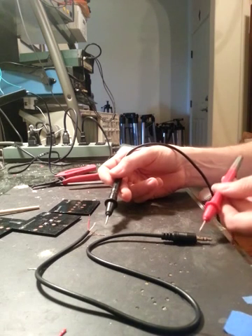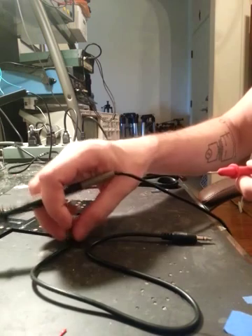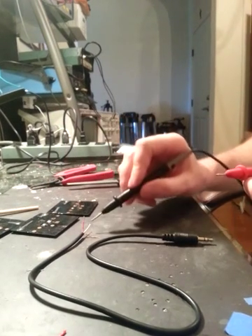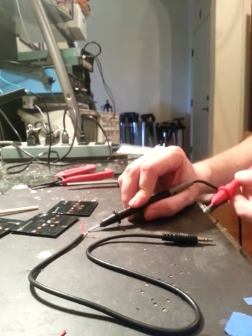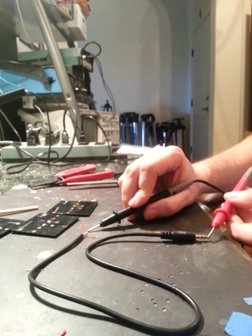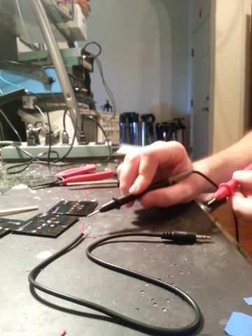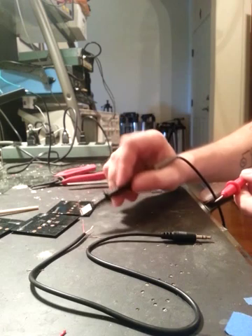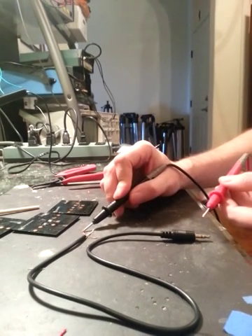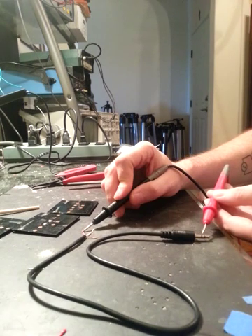So now I know: common ground right here. Let's take a look at the white wire — we'll just say it's left or right, it doesn't matter. This white wire is not the middle part; it's the tip. And the red wire, by process of elimination, is the central part — not either of those.